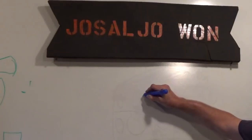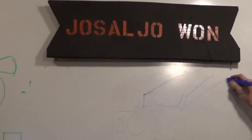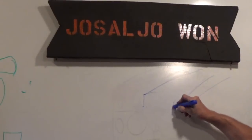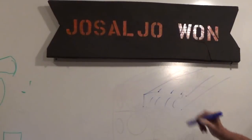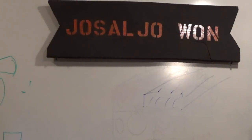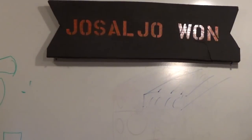Now when we say checking and splitting, what we're talking about is the end grain of a board, okay? So this is the end grain. There's your grain. We're talking about these little lines of separation that we get in here. These are known as checks. If they get too big, they're known as splits. Okay? So that's what we're talking about. So anyway, if lumber is dried at an even slow pace, checks and splits can almost be eliminated from happening. The key is what is considered slow and even.